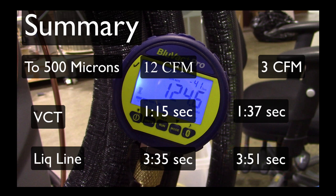There are a lot of other factors to consider. For example, that 12 CFM pump has a DC motor. If you had a lot of rooftop units to do with that DC motor, it says right in the manual you can run a 16 gauge extension cord up to 50 feet and not have to worry about damaging the motor. If you tried that with the 3 CFM pump that has a standard AC motor, you would probably damage the motor running it on a 16 gauge extension cord.